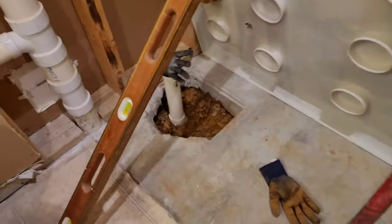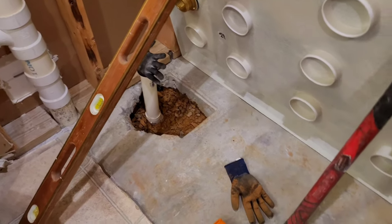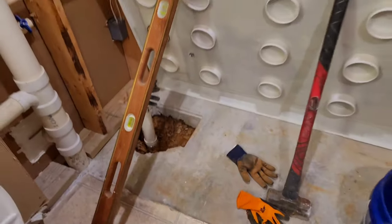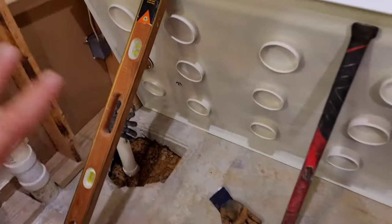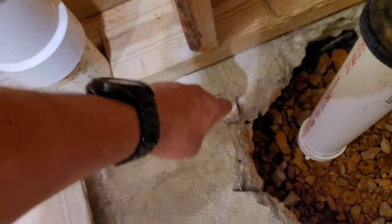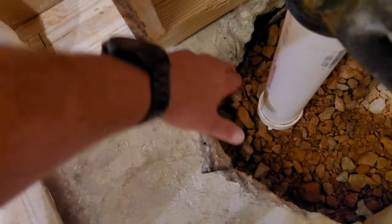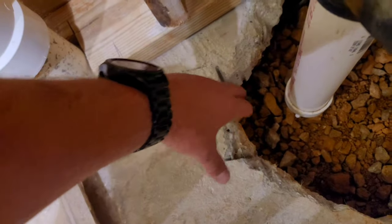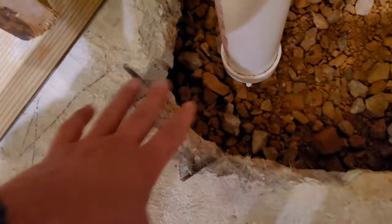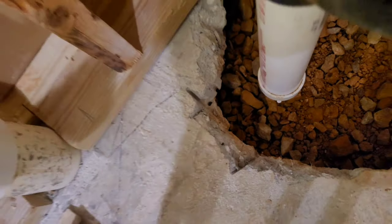If I do post this video, I'll put up everything — how I cut the concrete and all of that. It was a concrete saw on a battery-operated cordless Makita four-and-a-half-inch disc grinder. No matter how much dust you expect, triple that. You could not see from one side of this bathroom to the other — it was very, very dusty. I drilled holes with a masonry drill, then made cuts along those drilled holes. Then I busted it with a sledgehammer — just busted off the face of it — then made another cut once my saw would fit in there better, and finally got it to punch out the bottom.